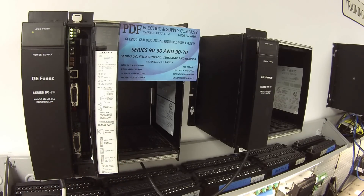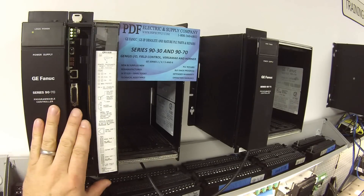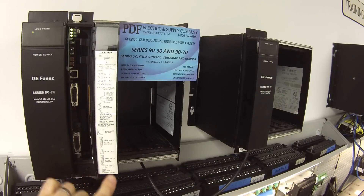These batteries are common to central processors for the 9070 series, which would include — the part number I'm using it on is IC697CPX928 — but it's also common with all the CPX line, CGRs, CPMs, and CPUs.